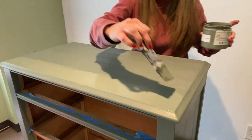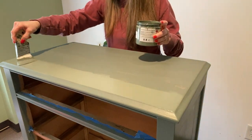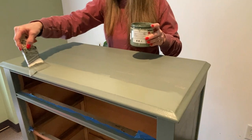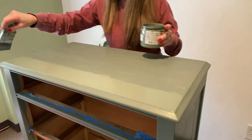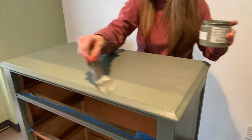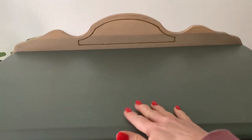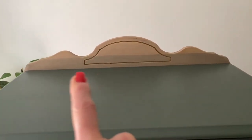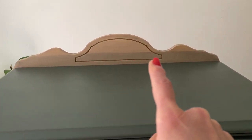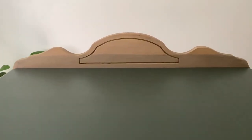As you can see, I am able to do long smoothing strokes since the first coat is now acting as that barrier. What's with that striation in the wood? It was the same way on the top of the dresser. I even tried to do a wash here to mute that darker tone — unsuccessfully. I don't feel like bleaching it, so I'm just going to paint it.